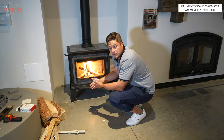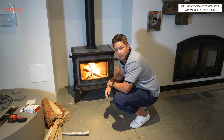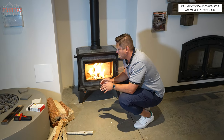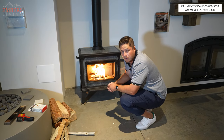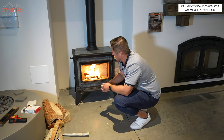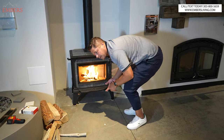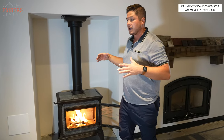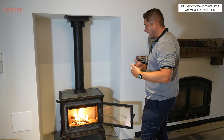Some people like to start what's called a flash fire — they'll just do a quick flash fire and sort of let it go out super quick with paper or whatever, and that can also heat up the pipe. That works too. I personally like just a steady Eddie approach — slow and steady wins the race. You've got to be patient; it's going to take a little while to get this going. There are other variables in play like altitude, how thin your air is, barometric pressure outside, depending on what the cold fronts are doing — all of that stuff can affect your day-to-day use on your wood insert.